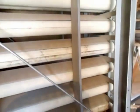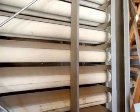You can see there's 2 rolls, and then the rough stuff gets thrown out underneath these covers out here and collected in the barrels down below in 3 different grades. You'd be used on clover, hairy vetch, anything that's smooth and that's small that'll flow. They even made some bean polishing ones that had bigger openings and bigger covers. It's a simple machine. And that's what we're going to use to clean the vetch.